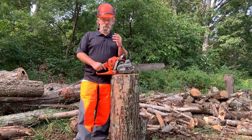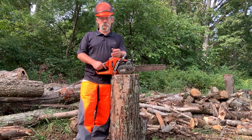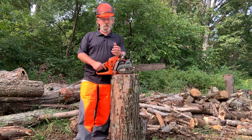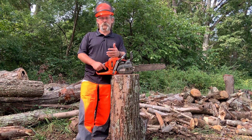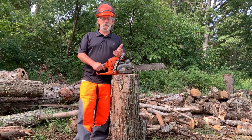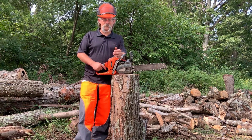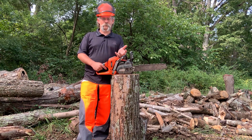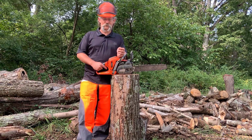That open face notch allows that tree to continue falling all the way to the ground, where a common notch or a 45-degree notch, it snaps, it breaks way before that tree is on the ground, and it can allow it to then fall in the path that it has the most amount of lean or weight, which most likely is away from your intended direction of fall or your path of least resistance, causing damage to your residual stand, or creating much more work for yourself by losing that tree because the notch closed before you needed it to.